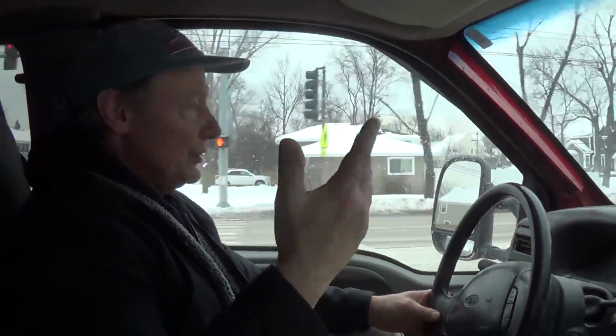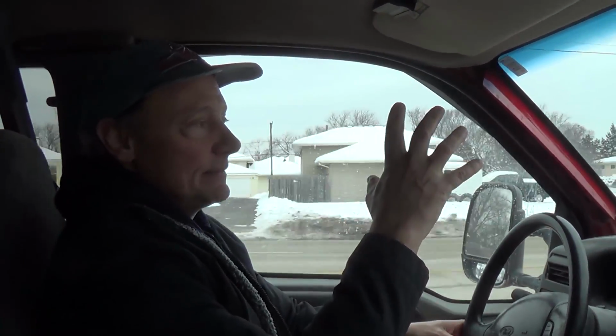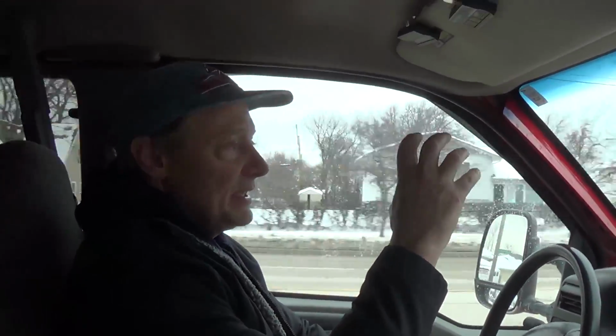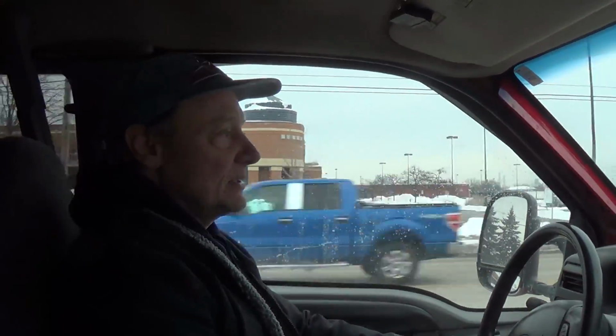Well, when you're doing drywall, if you were to just try to mud on wood and tape on wood, it doesn't stick. As soon as you get that moisture on the wood, it expands and sucks up all that moisture. And over the next couple of weeks, it just contracts, and everything just flakes and falls right off. So yeah, drywall mud is not going to stick to wood.